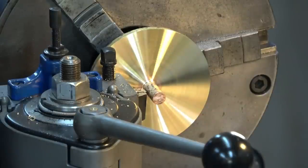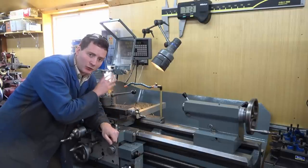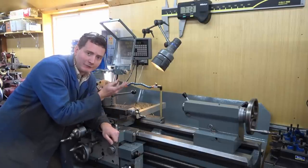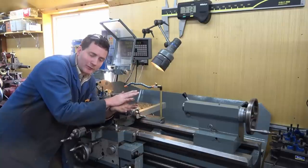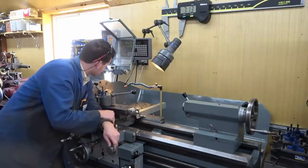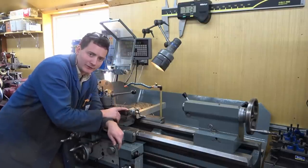So that's a bit more like it, and what I did there was I lapped the edge, dropped the spindle speed, and I also gave it a heavier than typical finish cut to load the tool up, load the workpiece up, and stop it from ringing. That has done the job, and I'll now proceed with the rest of the features.